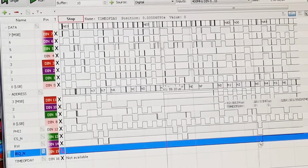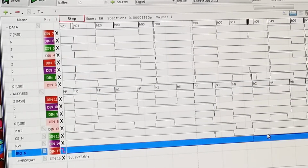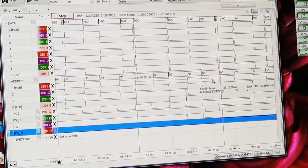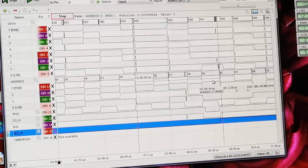Okay, I see also that it goes up again here. For some reason, I can try and see what. Well, we're writing 1 into the port register A though. Still working, but I have no idea why the count isn't picking up in the timer.